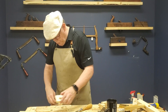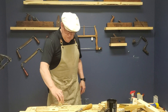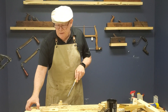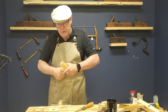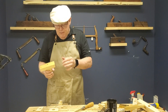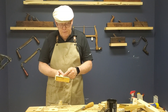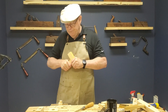So that's close — we're not quite there yet, but the top is okay while the bottom is not. It's close, but just not quite there. Now the first time I did this, I actually made this one about a year ago just testing it out. It's not real pretty, but it's my first one. I have tried my best to break this joint apart without taking a mallet to it. Because I wasn't careful about the shape, it's more of a cone or trapezoid in there — at the bottom of the mortise it's not making good contact, but even with that misshape, it's still a strong joint.